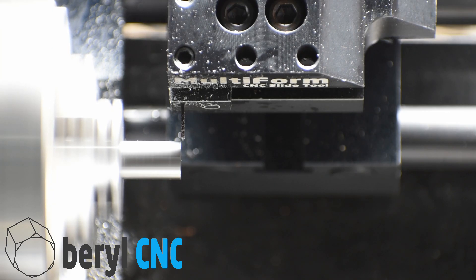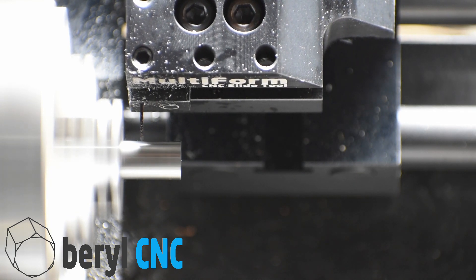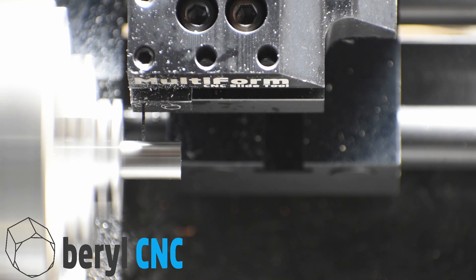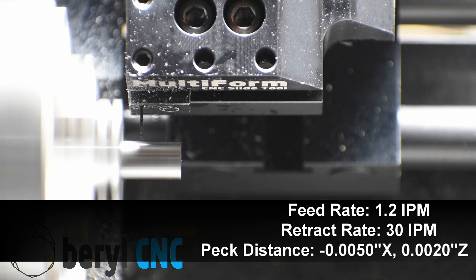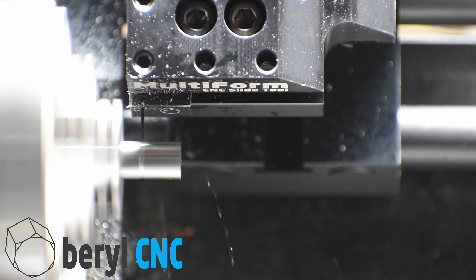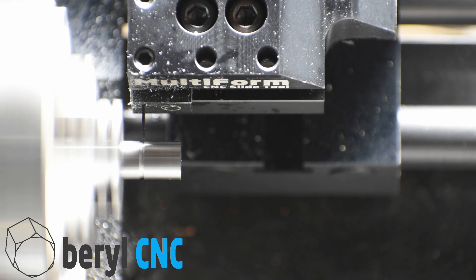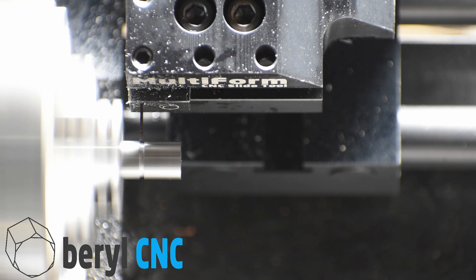It's time for the parting operation. We'll cycle start that and the cutter is going to move over to what happens to be three-eighths of an inch from the origin, and it's just going to take its time and peck its way through that steel piece. Now it is moving in X and Z, and that's very important because that allows clearance for those chips. That's an artifact of using such a narrow cutter — a thirty thousandths carbide — it's very, very delicate. Moving in both those directions is something that experimentally has worked out very well, as you can see here.